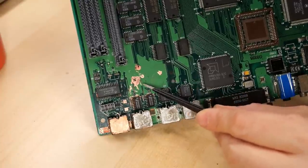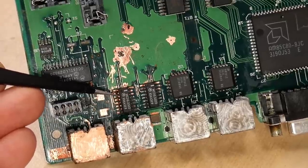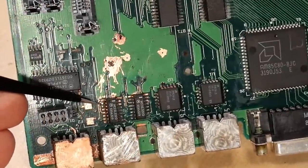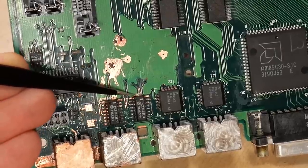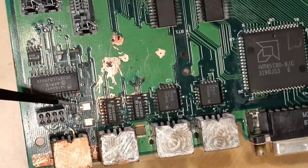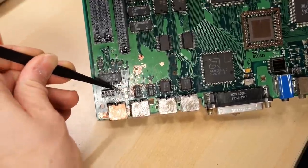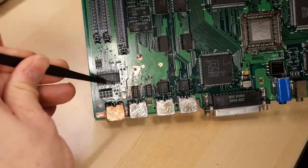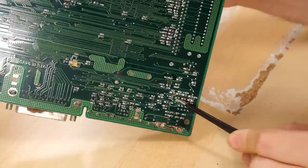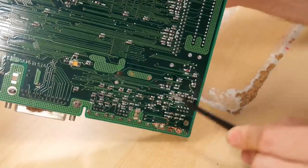I've gone ahead to remove most of the corrosion from this area — a lot of physical scraping is required. And yeah, things don't look good. See right here how all the pads are copper? The corrosion has basically eaten away all of the solder, so this chip is not even really held down — it's only held down on a couple pins over on this side. This chip here probably has a couple pins that are no longer soldered. Same over here; there might be problems with this chip as well. I can also tell that there are traces that are just completely gone. Like this trace right here, I think it supplies power to something down here. The ferrite bead completely just came right off, as did the clock crystal — those are gone. Looks like a trace goes from that via somewhere up here, and there's no trace left on the top anymore — it's just completely gone. Flipping around to the underside, there's definite carnage as well — just these vias and traces are not there anymore. The copper is completely gone entirely.